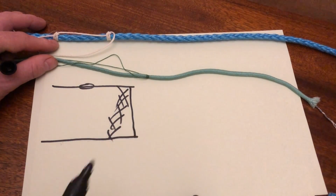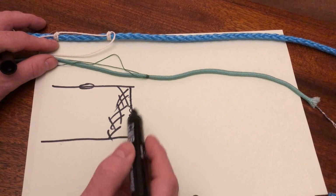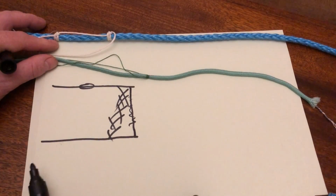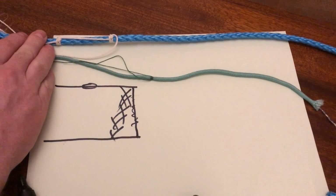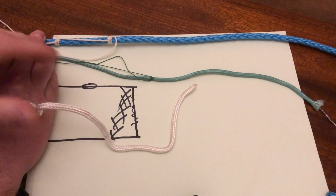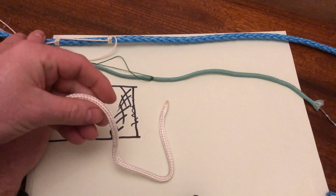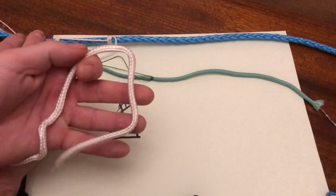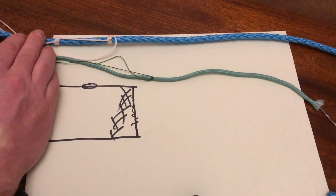That is the gill of the net, because that's only mono, and if you're hauling on the top rope you'll just rip the mono instead of hauling the bottom rope as well. So what I use for gill material is braided nylon. That's quite fluffy, so the knots bite in. That's hollow, so I can also splice it, and that makes a really good gill material.